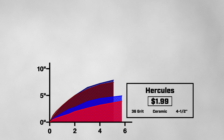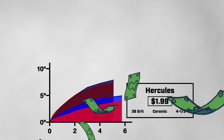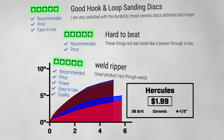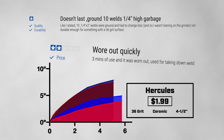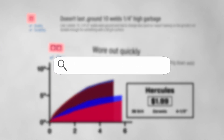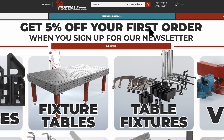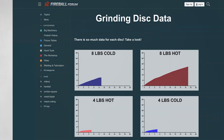So what can we take away from this? Well, this disk is $1.99, so it seems these reviewers felt they were getting their money's worth even if it did not perform the best. I would say that the reviewers that gave it 5 stars were using heavy pressure on cold metal, and the bad reviews were because of them grinding on hot material with light or heavy pressure. If you'd like to see the data I've collected for this disk, as well as the other disks in these tests, I've posted them at the Fireball Forum linked in the description.